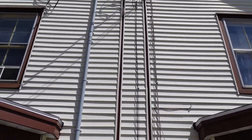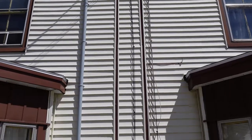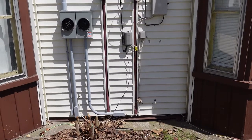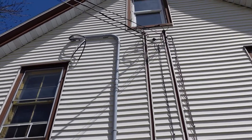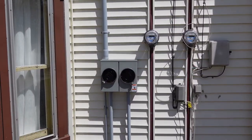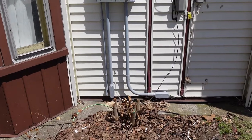What we have here is an older property — it's a duplex. Coming into the property we have two old 60 amp services. Now the minimum here where we're from is a minimum of 100 amps per unit, preferably 200. So what we've done is installed a 200 amp service coming down into two 100 amp per position meter bases, and then we're going to two 100 amp panels inside.